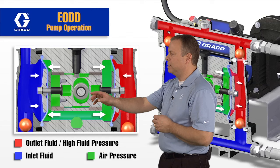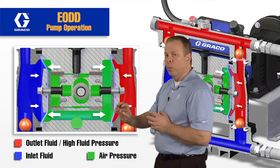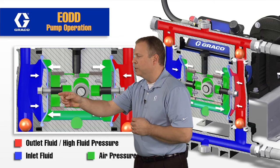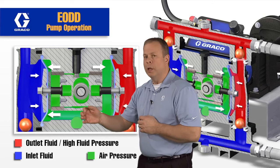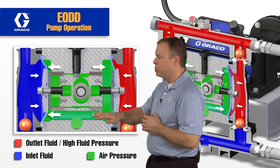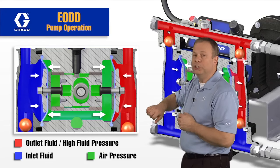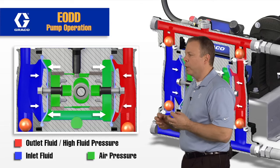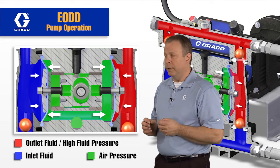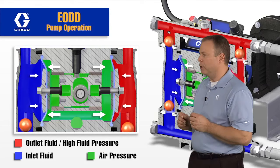Basically what's happening is as this roller is coming around, it's forcing this center carriage over. When it's doing that, this little pin right here, or the diaphragm shaft, is in contact with this carriage. So as this carriage is moving over, it's actually pulling that diaphragm back. This compressed air that I talked about is actually putting pressure on the backside of this diaphragm and causing this diaphragm to push into the cavity. So there's two things going on: we've got the rotational cam that's pulling one diaphragm, and the internal air pressure that's pushing the other. We're going to start this back up again and talk about exactly how that compressed air is working in there.